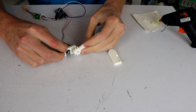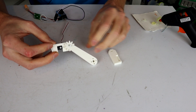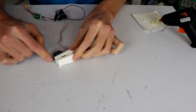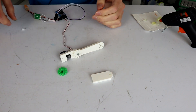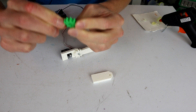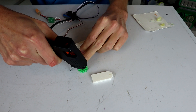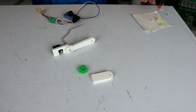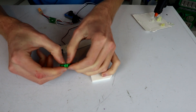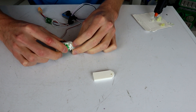Here's that new part — it just slips right on there. It is actually a little bit loose; I got my tolerances just a little bit wrong, but it will be okay for testing. I also printed the other side, which sits over here somewhere, but we need to put the servo gear on first before we do that. I also printed a flexible PLA servo gear, which hopefully will take some of the impact away. I'm just going to hot glue the servo horn in there temporarily, and I've set the servo up so that it is exactly on center.